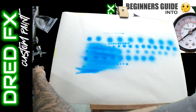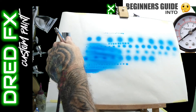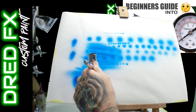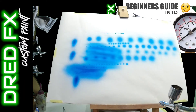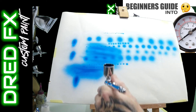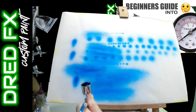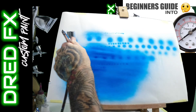I'll hook the PS290 up and crank the air pressure up just a little bit. I'll show it to you at 25 first - we'll drop some paint in, this is straight out of the bottle. So this is at 25 PSI and as you can see it's very speckly around the outsides - it's getting the paint down but it needs to be thinned out slightly to atomize a little bit better. I've just dropped a little bit of water in and that's atomizing really nicely now. So the PS290 can run really nicely at 25 PSI.